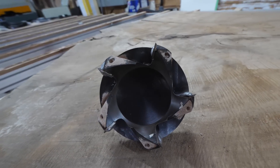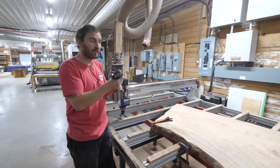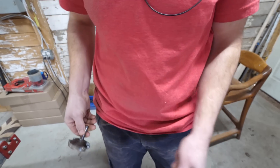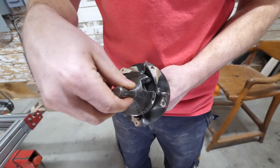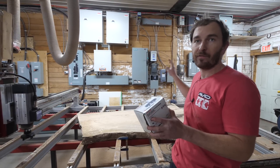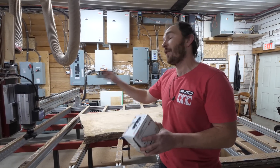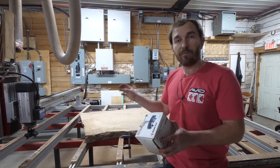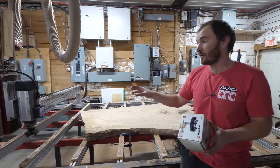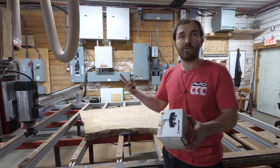Now for the beast — we're going to put in the RC2259, which is like five inches in diameter, and do the final pass on the slab. This is where I'm really liking this program — I have a maximum RPM of 12,000 RPM. Before I had to calculate by adjusting the hertz on the VFD, but now it does it automatically right in the program, which is really nice. My six horsepower just wasn't enough power to run this bit. You could still do it, but a lot slower and not take as much wood. I think this is really going to speed up our efficiency — we can take a much wider pass, probably a two inch step over versus a one inch step over. That's two times efficiency right there.